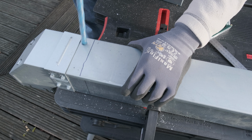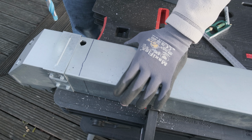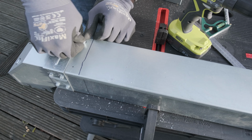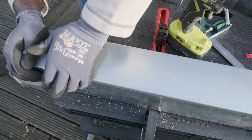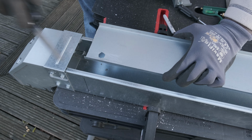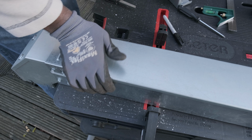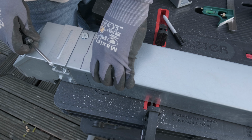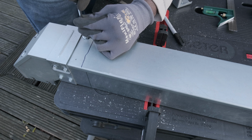I don't know if it's the drill bit or the material the lid is made out of, but I can't seem to manage making a round hole with these. I guess I should be using a step drill bit. Here you can see me struggling to fit the clip, which isn't going to happen until I clean up the tear-out, which I'm doing with a file. Make sure this is as flat as possible or the clip won't turn well. Now I can fit the clip in, albeit with the help of some percussive persuasion. Then I make sure the turnbuckle turns easily enough, and repeat the process for the other one.